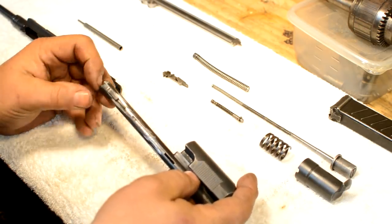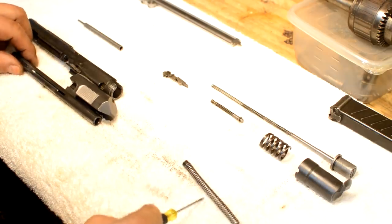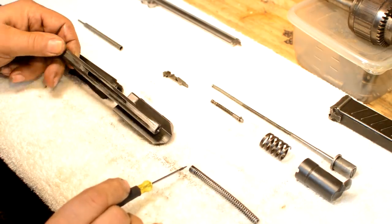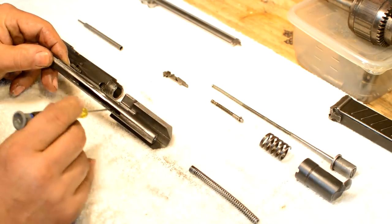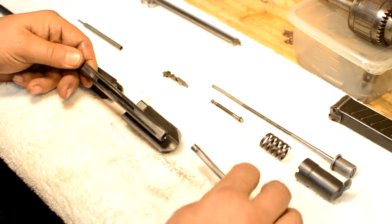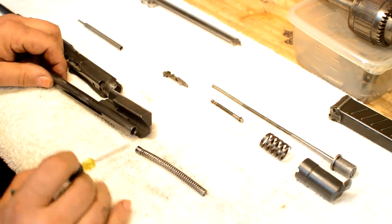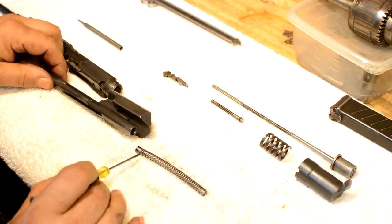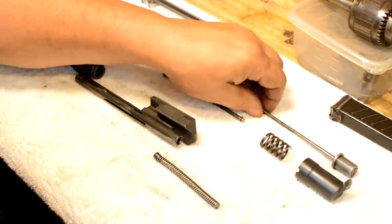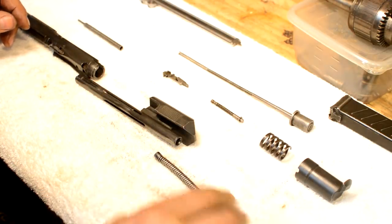I may in the future have to make an extractor for this, but for right now, the way these guys tried to get out of this was they made a collar for the front of this. We're going to go to the whiteboard and I'll show you what I'm talking about. This collar has had the absolute terwillikers beat out of it by a step right here. This whole part of the hole is 4,000ths of an inch larger — or smaller — in diameter than this hole. So this piece goes up inside there and it stops. When this spring is fully compressed, it will go coil-to-coil — two-block — about three one-hundredths of an inch before this device runs into the back of its spring guide. Meaning 10,000 to 20,000 pounds of force were put on that collar, and it mauled the thing.